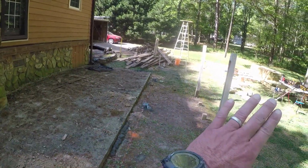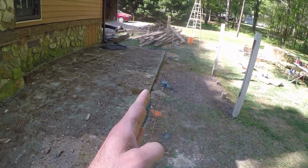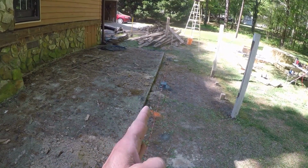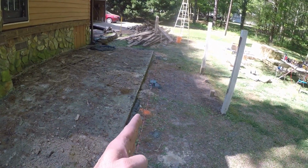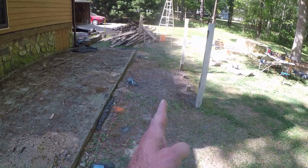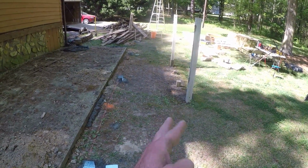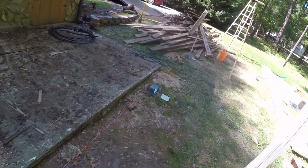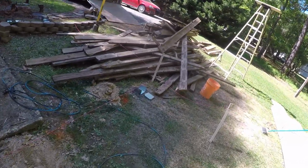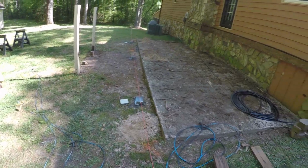That 2x8 is going to hit this right at 10.5 feet, but a 2x8 can span 12 feet. It'll run and land on top of this beam at about 10.5 feet, but then it'll come on out. The deck's going to have a cantilever. It'll come on out to 12 feet. So I'll have one about 30 foot double 2x8 beam running through there.